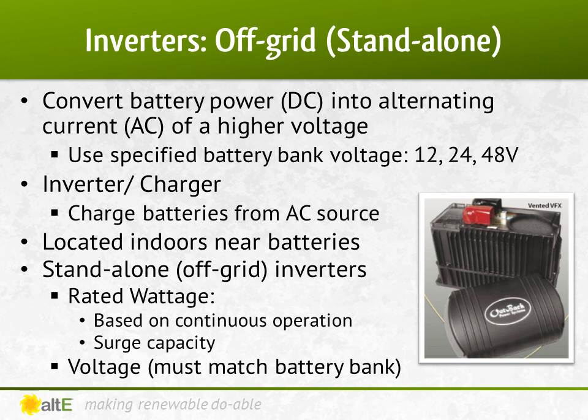For instance, if you have a boat or an RV with an inverter charger, when you connect to shore power, you can use the grid to charge your battery bank when the solar doesn't provide enough power. But that AC connection is one-directional — it will only take power from the grid, not send it back. Likewise, you can often connect a generator to the AC input of an inverter charger to top off the batteries when needed. This is a common configuration for off-grid homes that need more power in the winter than the sun can provide.